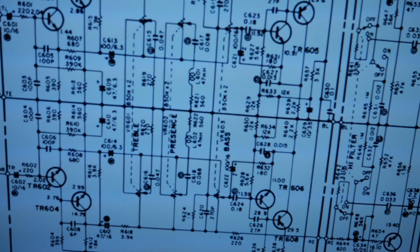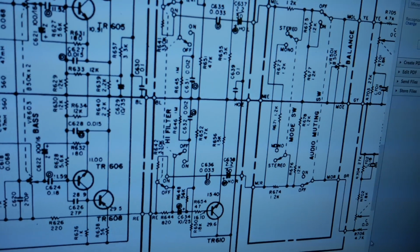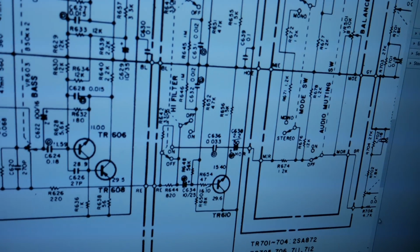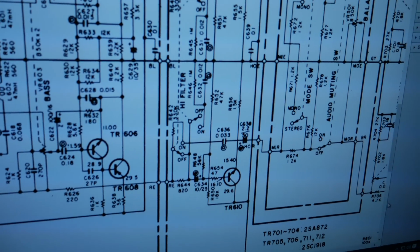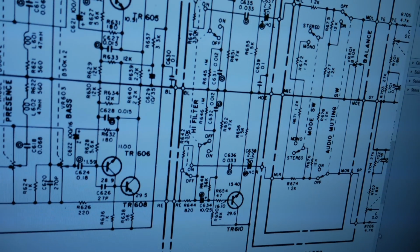So that was some pretty interesting symptoms in that. I've seen several leaky transistors over the years, but that was the first time I've seen one that made almost a perfect pink noise and also backfed in that fashion. So I'll have to watch out for that more often when I come across a symptom like that.